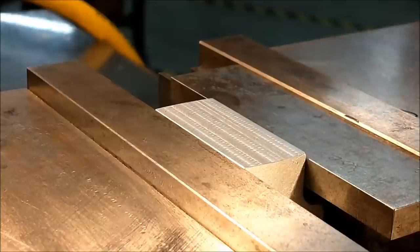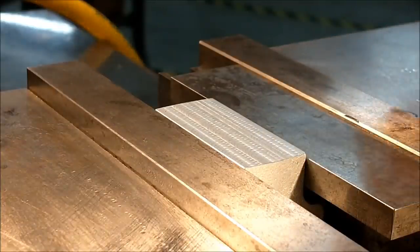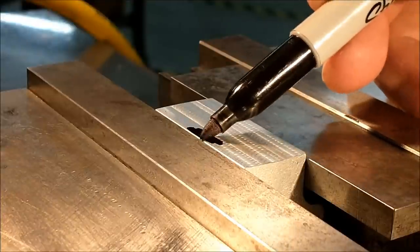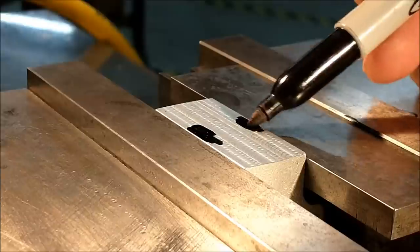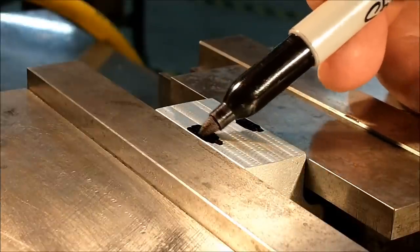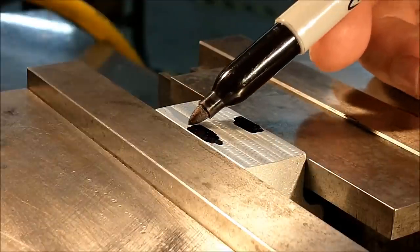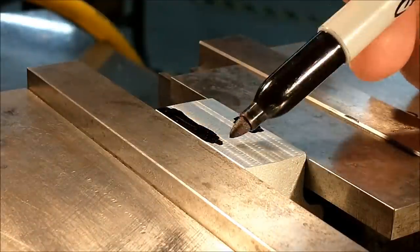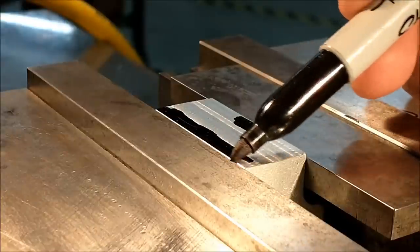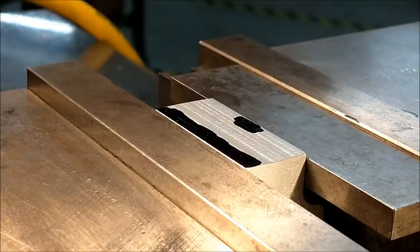Well, if the planets lined up when I got out of bed this morning, everything is set and ready to cut. I am looking for a pair of 70 deep grooves, calculated 70 deep. Now, because of the flat on the tip of the tool, it may not actually be 70 deep. But by using a pin and a gauge block, I can figure out what needs to happen. So we're going to cut a first track across that. We're going to set it to some arbitrary number. Have at it. Let's do it.